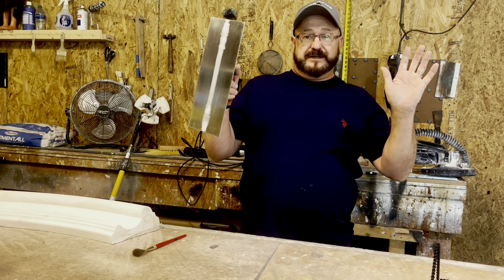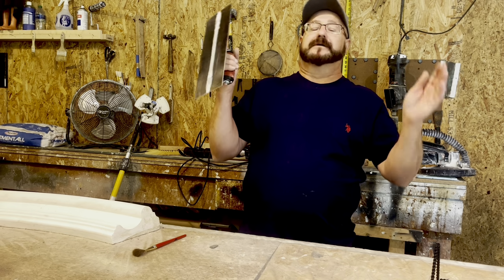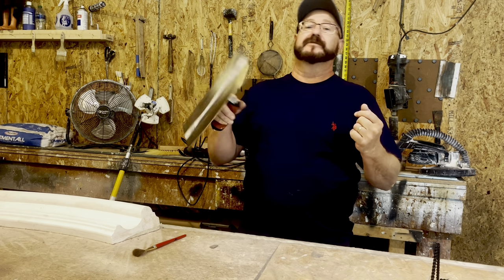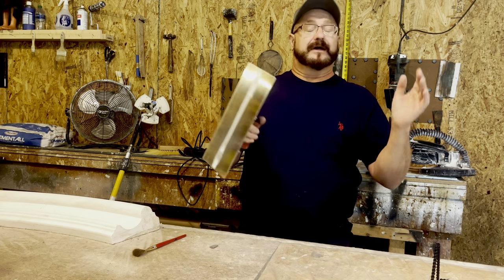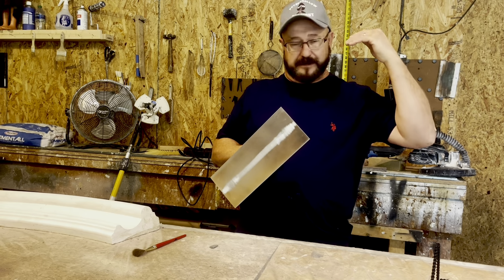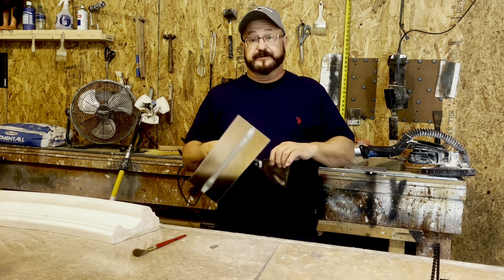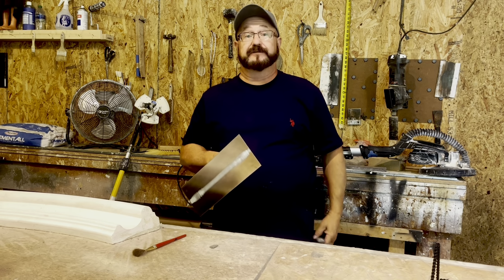After you've based this in, flattening it when you base it in, let it dry. That's what I did. But the video is just the base coat. But I did go back over and keep trying to smooth it down as I'd get lap marks. When it's dry, though, if you will hit it with a quick sander or scrape. I don't like scraping with my trowels. I like keeping good square. But if there's a little line, try to scrape it down flat.